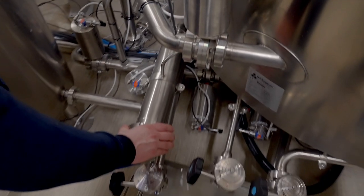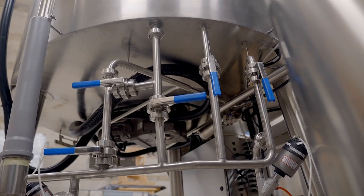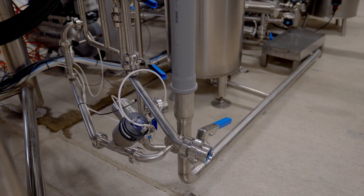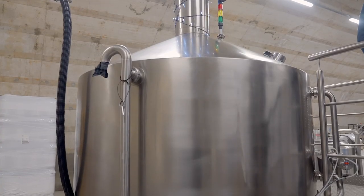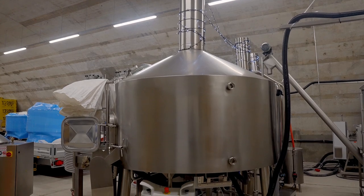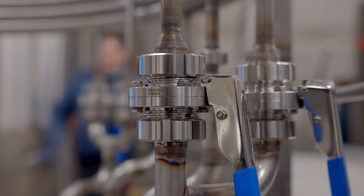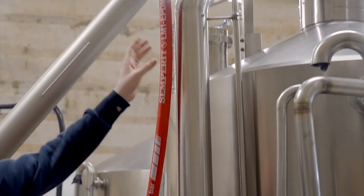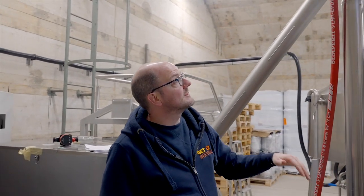Just to give you a look at some of the kit — you can see here the automatic valves and a little filter, with diaphragm valves if you want to adjust flow for your runoff and all sorts of things. The Brewix family of brewing equipment is plug-and-play for beginners — super beginner friendly for the 200, 300, and 500 — but this is showing you that Brewix are capable of producing fully automatic brewing equipment for large-scale breweries as well. The build quality, efficiency, and sustainability is just phenomenal. This is the condenser — so whenever you're using this as a kettle with a full boil, water is pumped into the spray ball, it condenses the steam, and the steam falls down in here, keeping the place free of a build-up of steam.